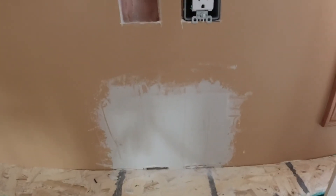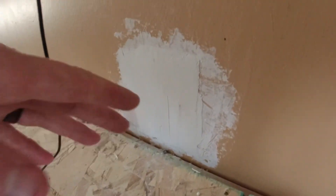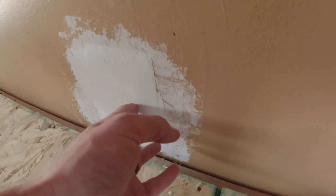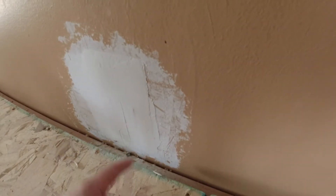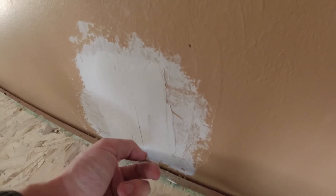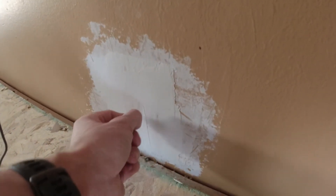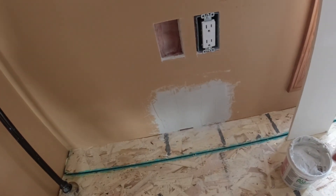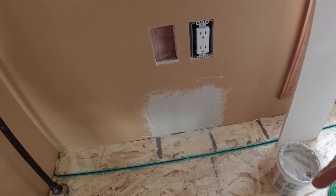That's how it looks wet, and over here is the dry one from the day before. The edges are a little rough, but all I'm going to do is take a sanding block and sand it down to break off the edges. This is the same situation where the bottom wasn't mudded in or attached, but now that it's dry there's almost no movement in the patch, which is perfect. The double one will ideally be pretty much the same — once the mud dries it basically locks everything in place and you won't even notice there was a patch there.